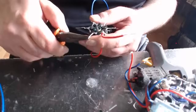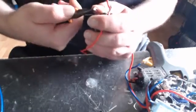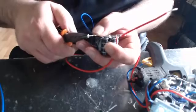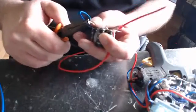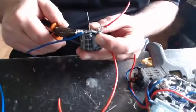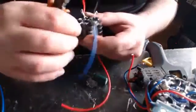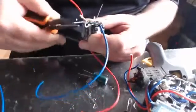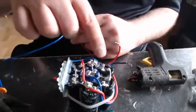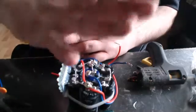So for security reasons, especially when you work with DC, try to finalize everything so it's smooth, so you don't get poked. Because you don't get shocked with DC unless you traverse the skin with the two leads, not just one. So always make sure, and that never happened to me, but that could be very dangerous. Apart from that, you don't get electrocuted unless it's 400 volts DC. DC, we're talking about, not AC. So I never wear gloves for this, but wear gloves in case, let's say you would fall on the spikes of this maybe when it's fully charged. And let's say real bad luck, you would have two of the spikes traverse the 3 layers of your skin to the blood, then you'd electrocute yourself.